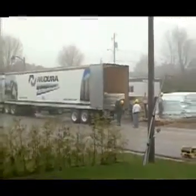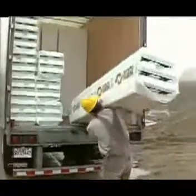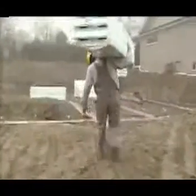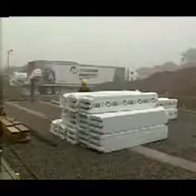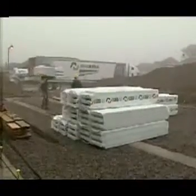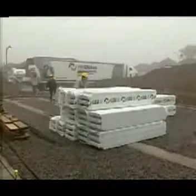Once the footings have been prepared, it's time to get the material ready. As you saw earlier, the collapsed forms are easy to carry because of their lightweight and compact size. Most installers find the walls go up faster if they stage their tools and materials within the wall perimeter. That being said, be sure to keep everything at least 6 feet from the walls — you will need at least that much distance to set up the alignment system once the walls are up.